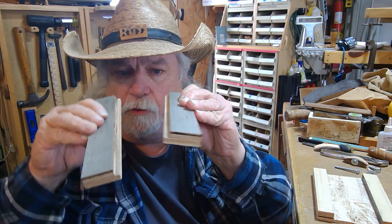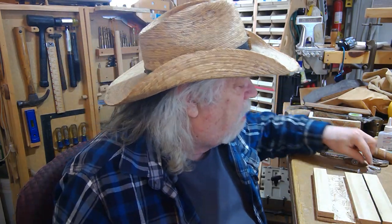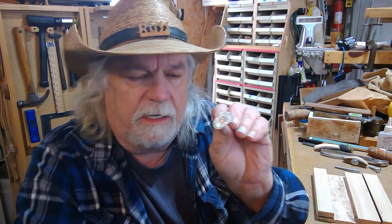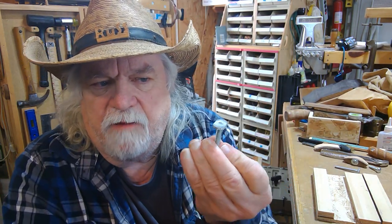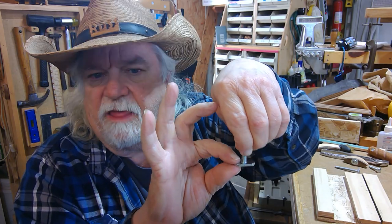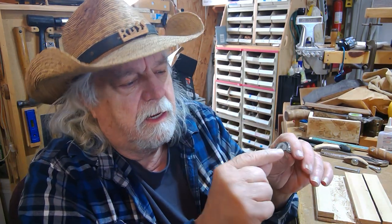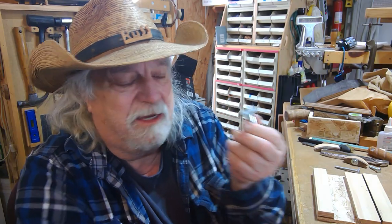This is a quarter by a quarter on the rabbet. That will get you by if you are using my design of a T-bolt with the slide-in T-nut. That's a one-quarter-twenty bolt, and the T-nut is an inch this way and a half inch this way, and an eighth of an inch thick. I put it onto the threaded rod and CA glued it in place — that's my bolt. These things work fine, and I've got less than fifty cents in each one.